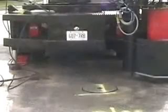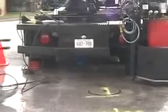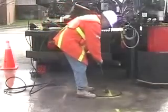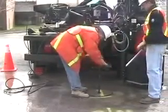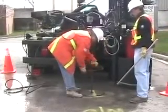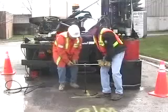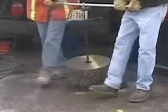Turn off the pressure washer and disconnect the hose. You are now ready to remove the core from the pavement. This is where you will appreciate the real value of the central pilot hole that distinguishes the Utilicore coring process — the ease with which you can lift the core from the road. To extract the core, simply insert the core puller into the pilot hole, twist the horizontal bar to compress and expand the rubber cylinder at the bottom, and lift the core out. A typical 5 or 6 inch core will weigh between 80 and 90 pounds. For heavier cores over 7 inches deep, it is a good idea to share the weight with a partner using a pry bar through the ring at the top. Remember to bend your knees and then lift the core out of the pavement and set it aside.